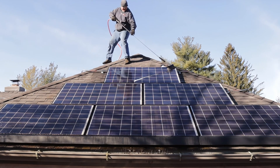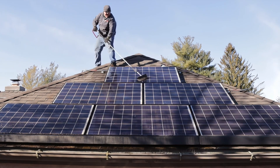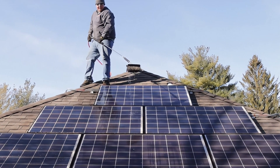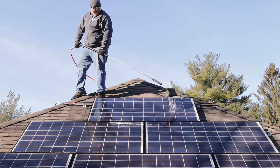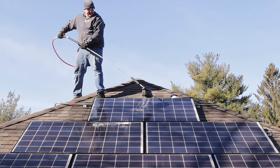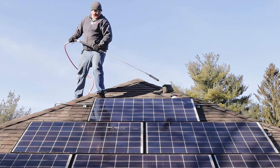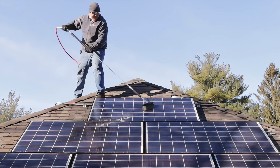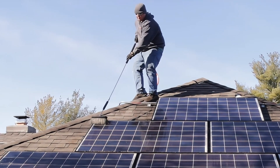Now, final rinse. You'll notice there are no real suds coming off — you may see the occasional bubble, but that's strictly because of air in the line. It's important to note when working with DI water: any aeration or agitation in the line will actually impact the final clean. So rinse as softly as possible, working down the surface.